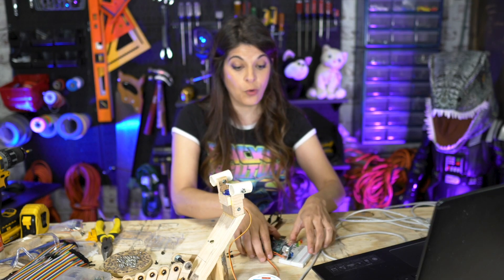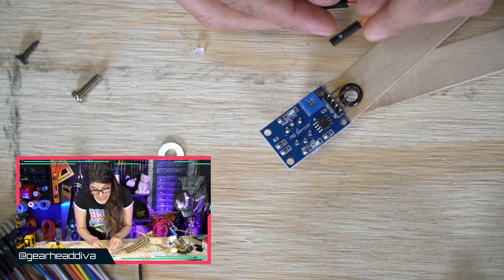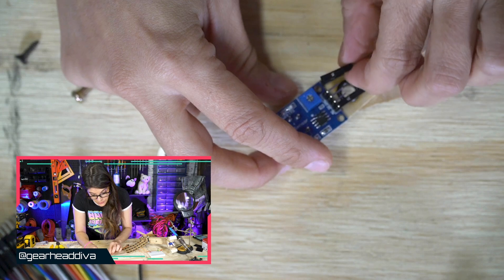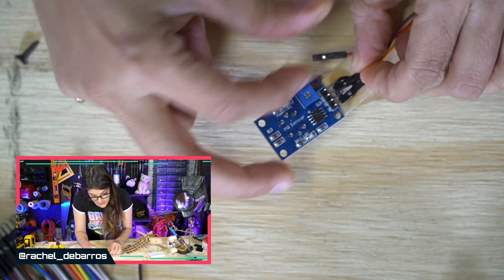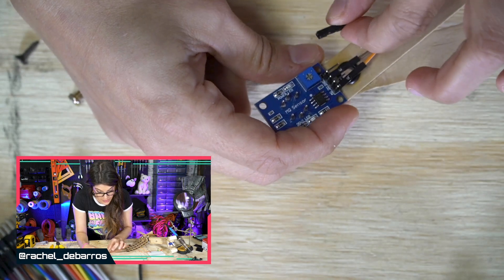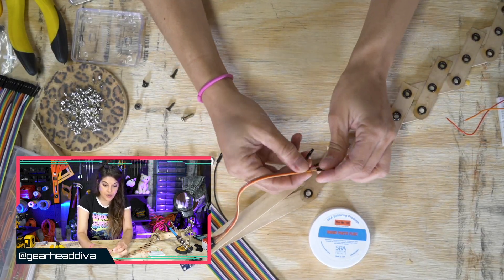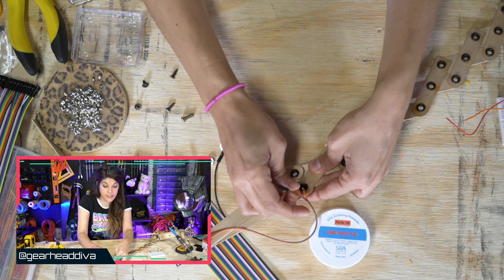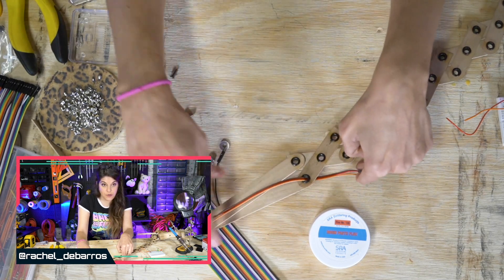One of the things we're going to do is totally eliminate this breadboard — we're only going to use the Arduino and the wiring directly. The first pin on the sensor is AO, which is our analog, so I'm putting the orange wire there. The next one is ground. I'm going to skip one, which is the DIO, and then the second-to-last is the ground. VCC, which is our power, goes right here. All three connectors won't fit at the same spot, so I'll have to weave them one after another. Also these connectors are all the same size — I probably should have gotten them in different sizes to make this easier.